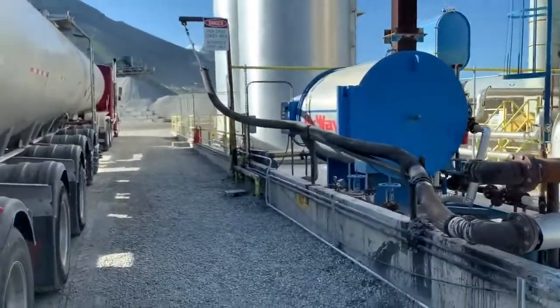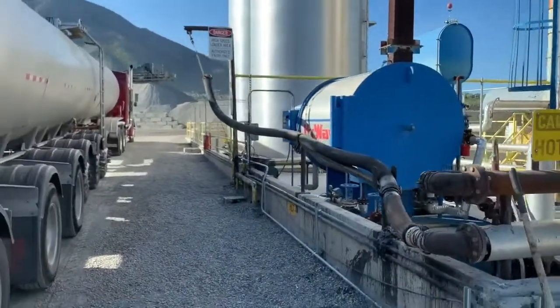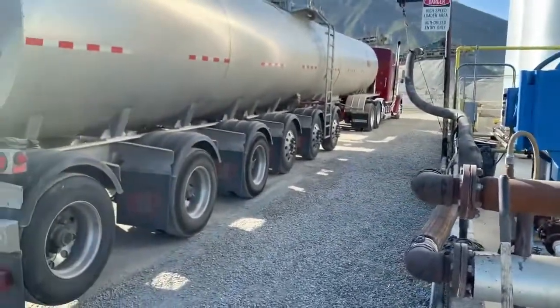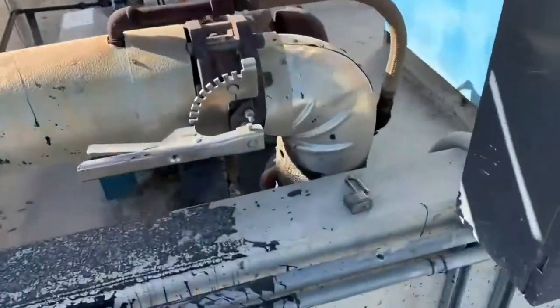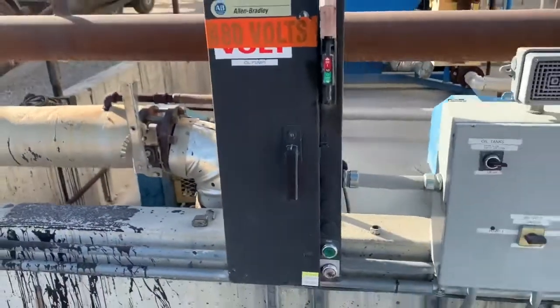I just put the hose away. You can see I hung it up — there's no droop in here, so all the oil can ooze down and out so the next guy doesn't have a plug. Working our way back whenever we're finished, we work from the trailer back to the tank. I've already closed everything down on my trailer, got my hose hung up. First thing I do is come right here and close that valve.